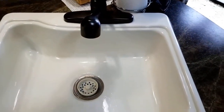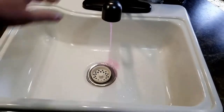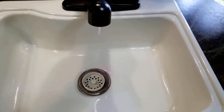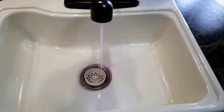My water pump just turned off so I'm going to start in the kitchen. I'm going to turn on the kitchen sink and let it go until I start seeing the pink RV antifreeze. There it is — I'm switching over to the hot. There we go, got a pretty good flow. I'm going to do this for each one of the fixtures in the trailer.